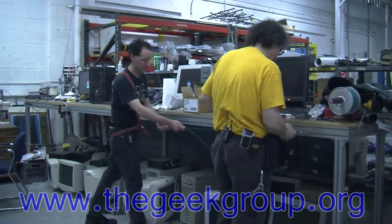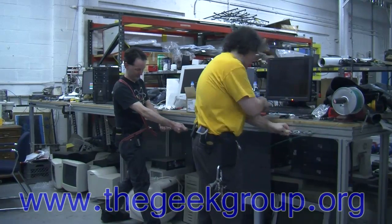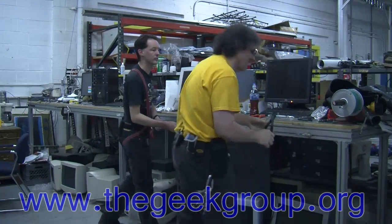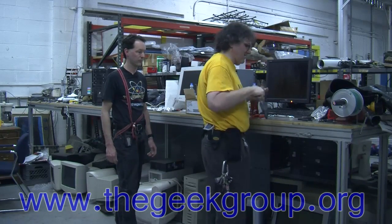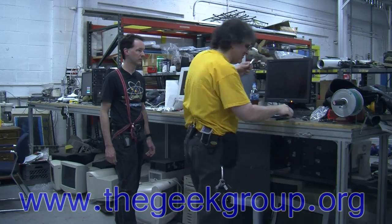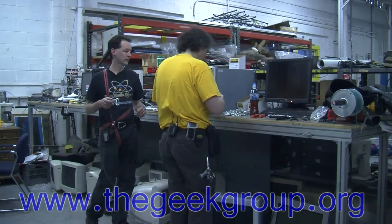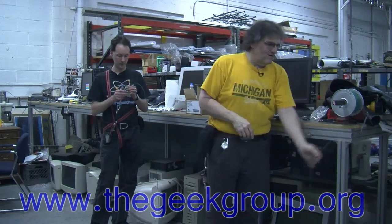All right, you ready? I'm ready. Now, Duck is going to hold some tension for me. Go ahead. And I'm going to slide the ferrule up to the thimble. And there's one crimp. Pull it off. And there's my second crimp. Cut it off so there's no wasted piece of wire there. Add another quick connect for the bowling ball end. Close it so it doesn't fall off, and okay. There you go. And now I'm on to another wire.